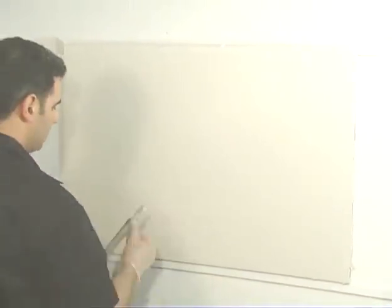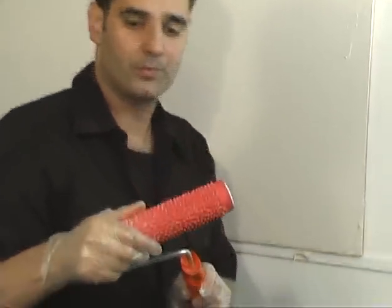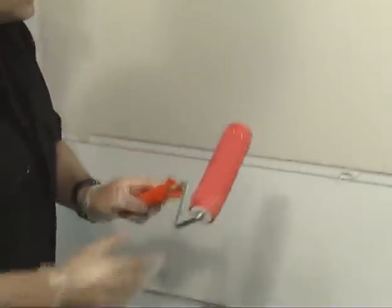Clean the excess material built up on the spatula as you smooth out the plaster. Take a pitted rubber roller and roll it across the still wet plaster to create small holes in the surface.